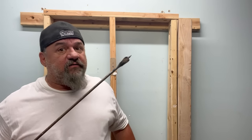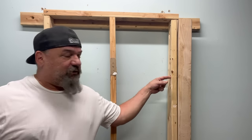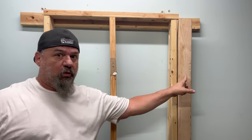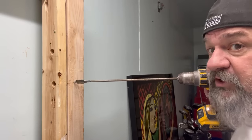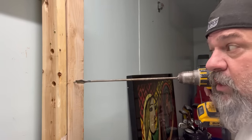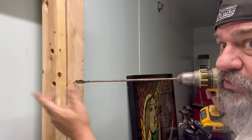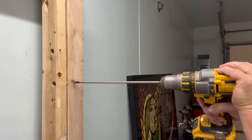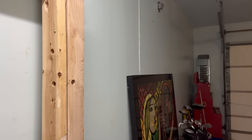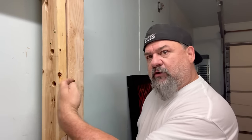Next we drill around the other side, right directly into it. We came out here, so we're going to drill right into it to create a 90-degree angle on the inside. I'm pretty much parallel with this other hole, so we're going to drill in again — only going this depth, about two to two and a half inches. I kind of broke through; I hit that other hole that came from the other side. Now I know it goes through at a 90-degree angle.